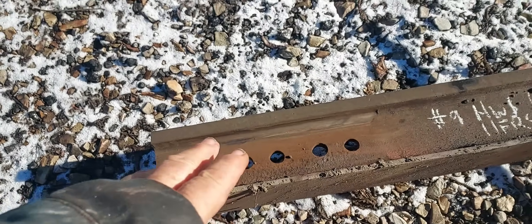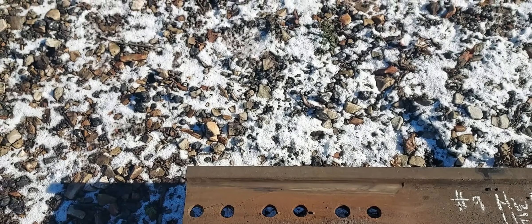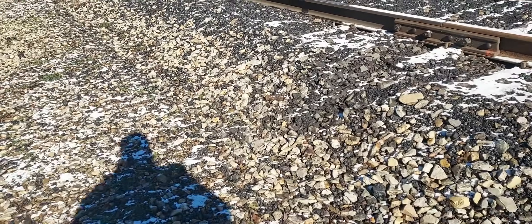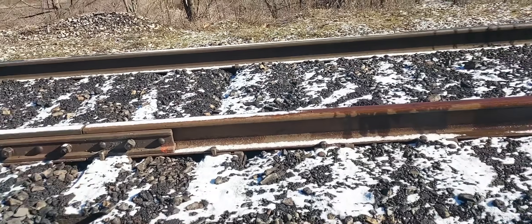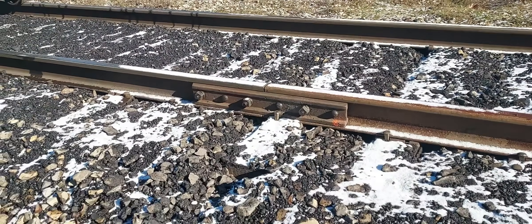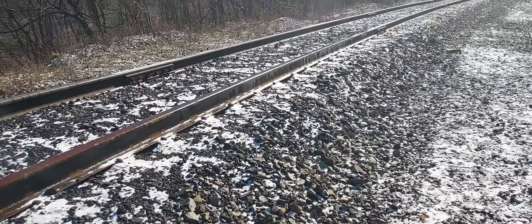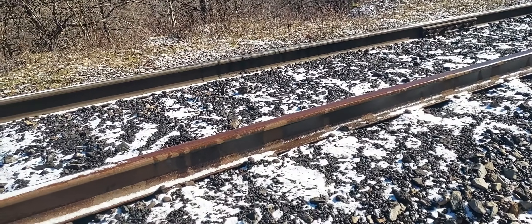The little bit of money they spend to find this — like that earlier one with 90% growth — we had two potential derailments waiting to happen here because of those defects. I don't know exactly what the ultrasonic testers charge — it depends on the company — somewhere between $5,000 to $10,000. But my goodness, if you have a derailment here or a mile down track, and that old rail had been in here and the head blew out with that 90% growth, it's just fantastic that we do get the ultrasonic rail testers in here. They sure save derailments in the future. I'm very, very, very thankful that we do that.